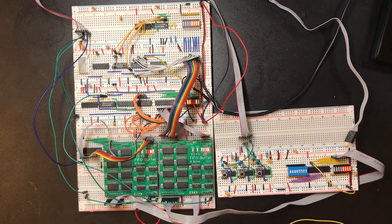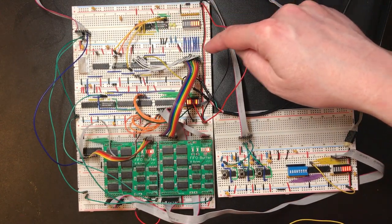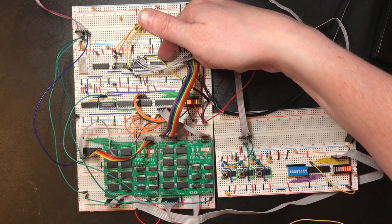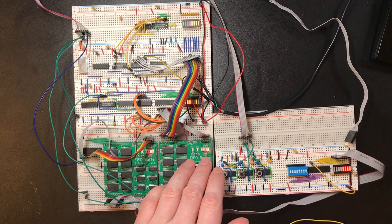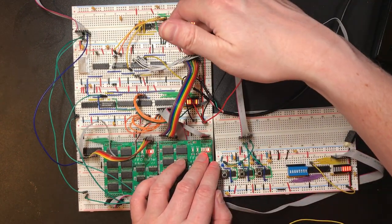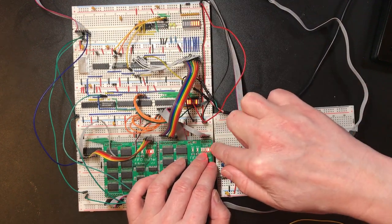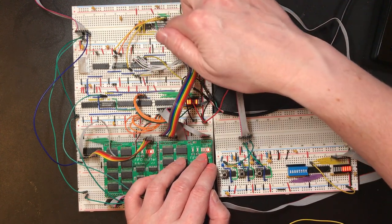That's cool. Because the transmit's not happening, all of this circuitry is now redundant and we've completely broken the transmit. Because rather than an edge detected signal to send a byte, which was directly triggering the load onto the shift register, what we're going to need is a circuit that says, if we're not sending a byte and there's a byte available, load it into these inputs of the shift register and shift it out. And so the two significant bits of this circuit is detecting if a byte is waiting and not triggering whatever that's doing while we're still transmitting.